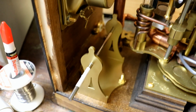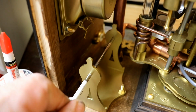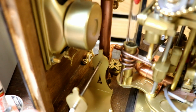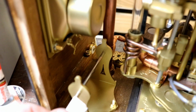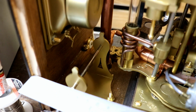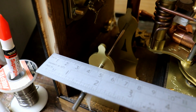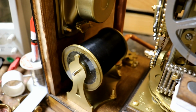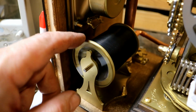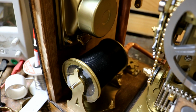Well, I've got that fixed down and I'm just going to cut the drive shaft, and I was thinking, how can I fix it in? Luckily the front of it now lines up with the back of that vertical copper pipe. If I just push this in as far as it'll go, I don't need any complicated grub screws, because I can put a ruler across where the back pan is going, put a mark on it and just saw it off. I say, Governor, what a lovely twirly thing. Just so lovely when you've got bearings in stuff. So that spins beautifully now.